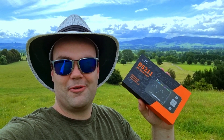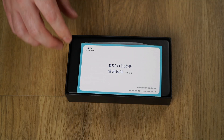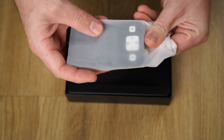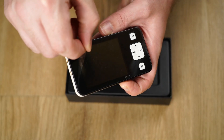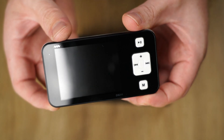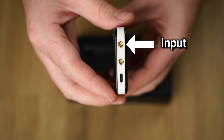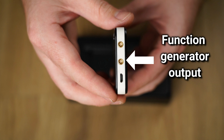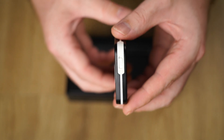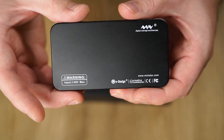First we need to unbox this back at my workshop. Inside you'll find a quick start guide and of course the DS211 oscilloscope. The display is a 2.8-inch color LCD screen with enough brightness that it can be used in broad daylight. On the front you'll find the navigation and menu buttons. On the left-hand side you'll find two MCX sockets — the top socket is an input for things like a probe, and the other socket is used as a function generator output. There is also a USB port for charging the internal battery and upgrading the firmware. On the right-hand side is the power on/off switch.